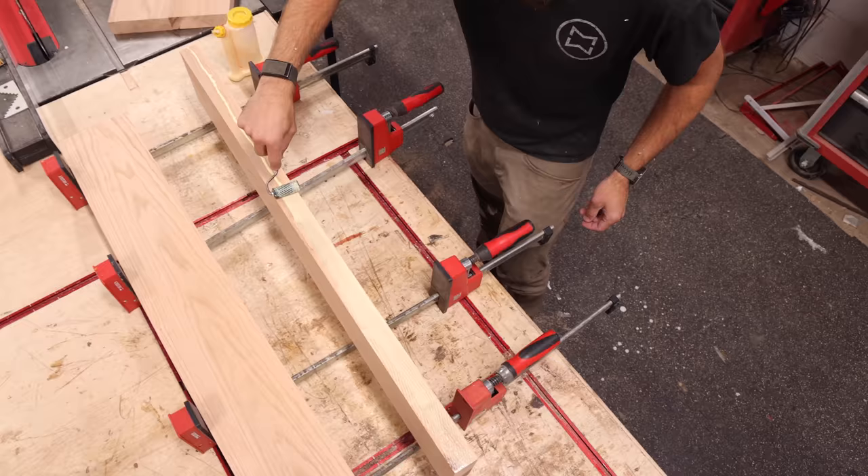We've got this thing mocked up. The top is not attached yet but it's got everything sanded to final. I'm actually really liking this — it's red oak but for some reason it's not very red, it's got more of a white oak vibe. I'm still gonna make it brown — a nice medium brown tone. I have to do at least part of the finish before assembling because it's a split-top design, so I can't get the finish down into the middle easily after it's assembled. I'll pre-finish everything, drill all the holes, touch up anything I ruined in the process, then put the whole thing together.